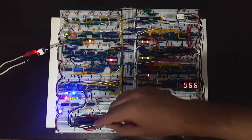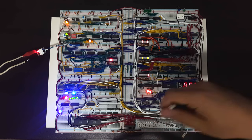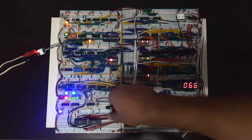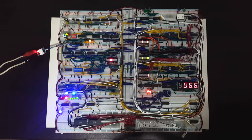The microcode is on EPROMs. You can watch Ben Eater's video which explains how you can replace pretty much any combinational logic with an EPROM. It's a really cool video and we've used it twice in this computer — here in the control logic and in the output module.